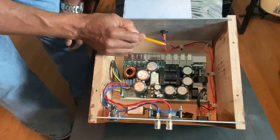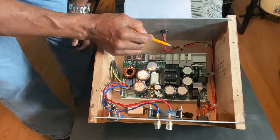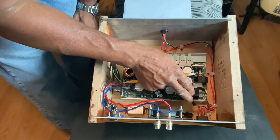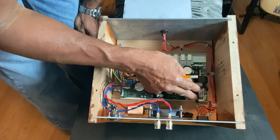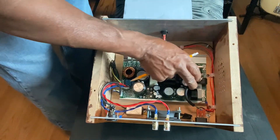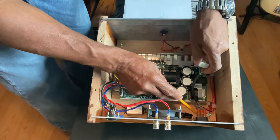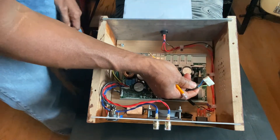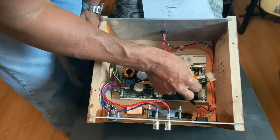Starting off at the top with the brass tab — you see this black wire here. I run it from the brass tab of the switch to my power cord connector, and it's connected to the neutral of the power cord connector. There's also another wire spliced with that — this blue wire coming off the neutral, which goes to the connector that comes with this amplifier. That blue wire goes to the neutral going into your board.